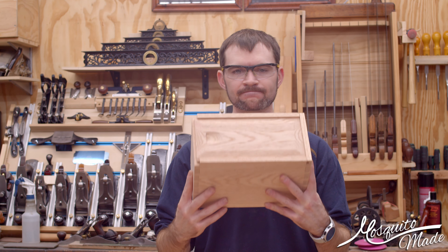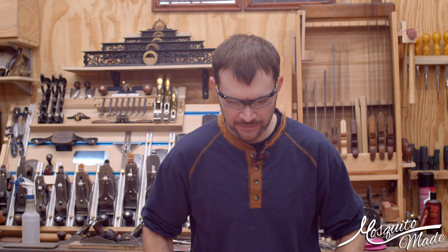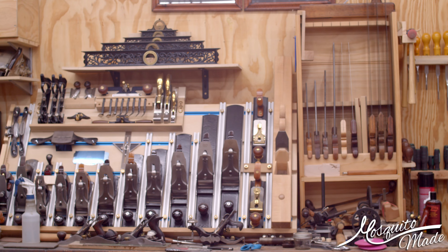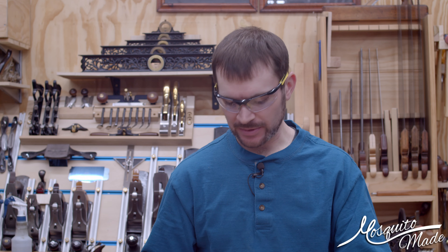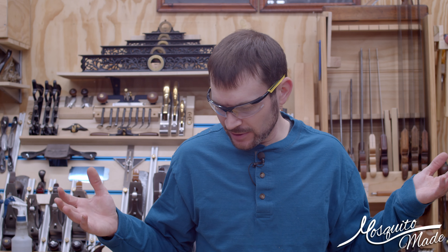There's the box in tonight's state, but that's it for me — we're going to have to pick it up tomorrow again. Sanding. I love sanding. I'm just trying to make sure that I actually come out here and work on it tomorrow because — lots of sanding. I've got our box all torn down, and instead of sanding all of it with a random orbit just because lazy, I think I'm going to go ahead and plane them instead, at least first, and then I'll probably come back with the sanding block. May the grain be in our favor.